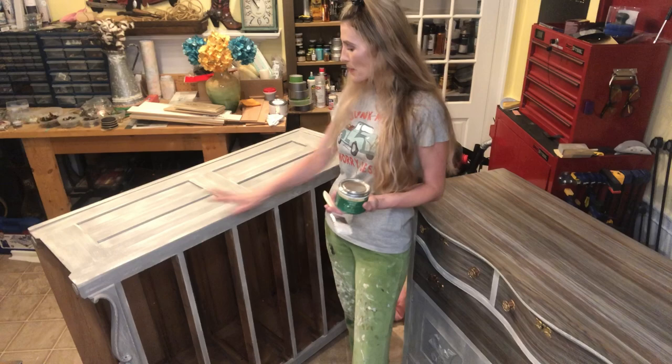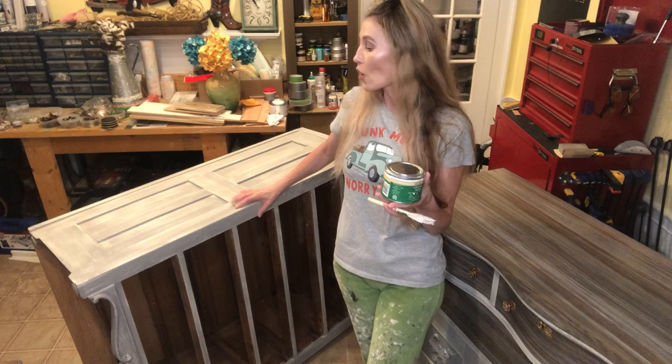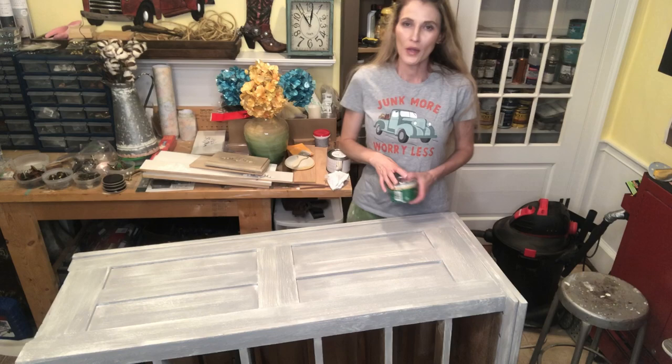This antique dresser is about 130 years old, solid oak. I've painted the sides in a weathered look — white paint, some grays — and distressed it. But I still want to add a little more white into the grain, and that's where the liming wax comes in. It's going to settle into the wood grain and make that grain pop, while also providing protection on the outside. Let me show you how I applied it and the results you can get — they are quite gorgeous.